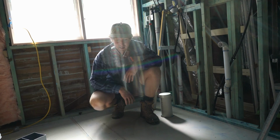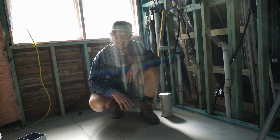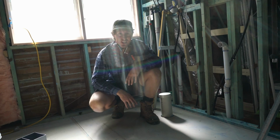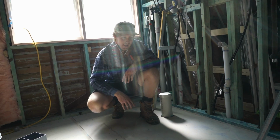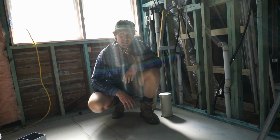Alright, so we're all done now with the flooring. I've got the cement sheets down, they've marked at 150 centres, all nailed off with the fibre cement sheets. I do know that you can use a coil nailer these days under the spec guide, but I just never, to be honest, have found, well, maybe it's just my skills or maybe it's the gun, I'm not sure.